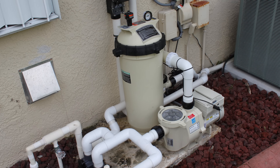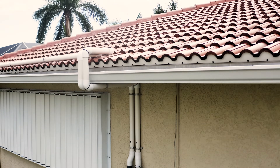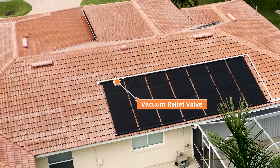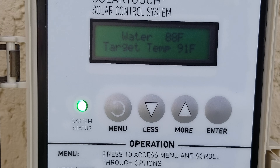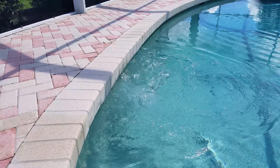Shutdown. When your pool pump shuts off for the day, all of the water in the solar panels and plumbing drains back down to the pool. Air is admitted into the system through a vacuum relief valve on the roof. Sometimes you may hear air hissing from the valve when it opens, and you may hear gurgling as air replaces water in the pipes — this is normal. If your solar pool is automated with a controller, it may shut down and start up several times a day, and each time the system starts back up, you may see bubbles in the pool for a minute or so.